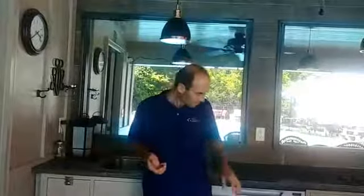What's a good idea for cabinets? There's a couple of products that are really good for cabinets. If you take an indoor cabinet and put it outside, you'll probably be disappointed in about 2 years. Most cabinets that you put inside have particle board sides. Even the higher quality ones might have plywood sides, which is fine, but they aren't made to not absorb water. They're porous. They're made for an indoor environment. In fact, many of you may have had a water break under your cabinet in your sink and had to replace all your cabinets because they absorbed water. So you don't want that in an outdoor kitchen.